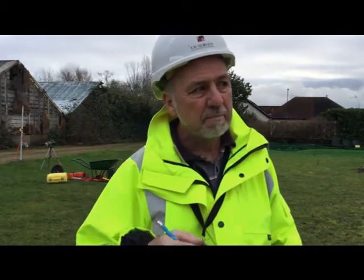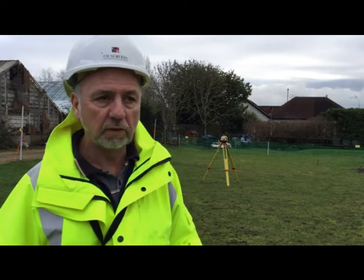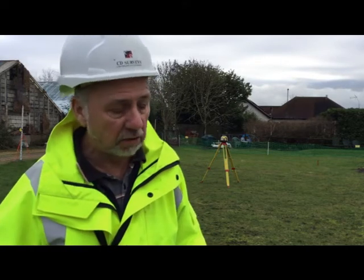So time spent getting a good survey, getting a lot of detail, if you need that information later on to do any further design or any groundworks or engineering, then at least you've got the information, as opposed to going back to site and the site had all changed.